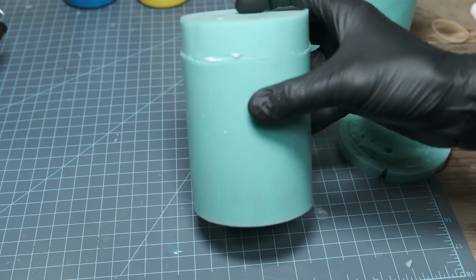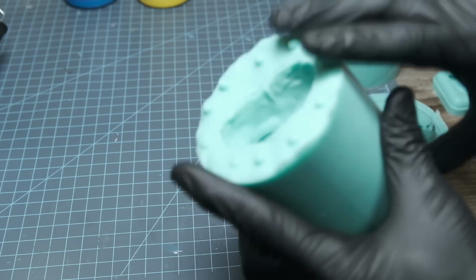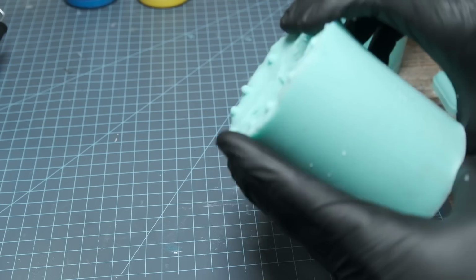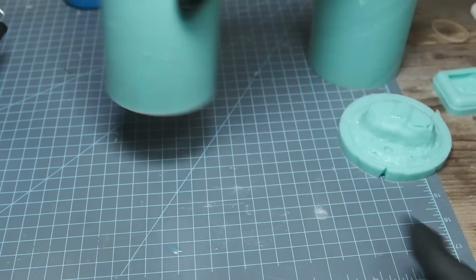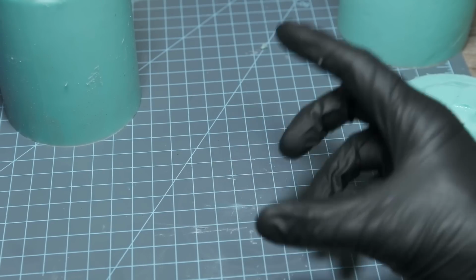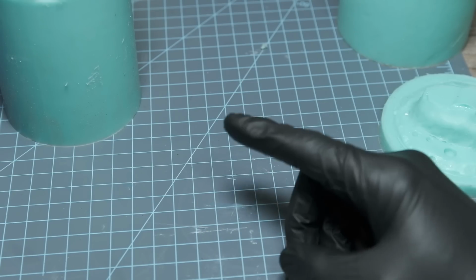And I was very happy with this style of mold, as far as it's a 2-part mold, but the seams would go along the bottom of the character. See that? And then I could just pop it, and then once them 2 little eye sockets, pop, pop, you go pop like that. And then you can just pull it on out. So I said, Crafsman, you finally done made you a decent production mold. But it did not work. Why? Because it was a 3D printed object. The 3D print resin inhibited the cure of the platinum silicone.